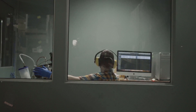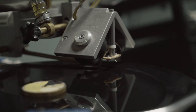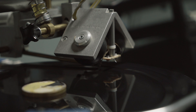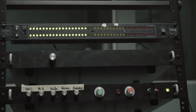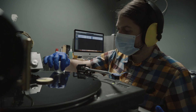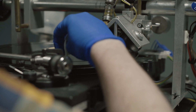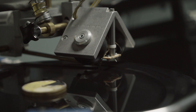So the audio file, once it's approved and ready to go, gets cut directly into the disc. There's an actual cutting head attached to a playback system. The playback system sends the electronic signal to the cutting head, and the cutting head physically cuts the grooves. It's got a sapphire tip on it and physically cuts the grooves into that master record, so you have an actual physical record.